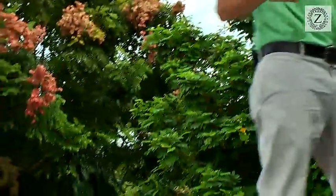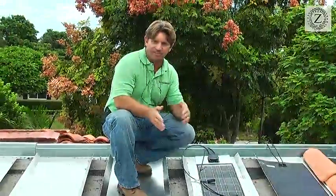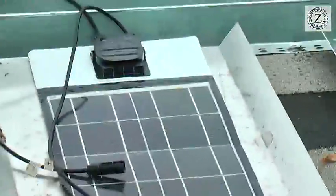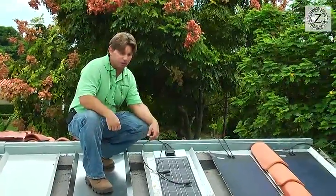This laminate you can walk all over — you can drag your feet. One of the advantages of the metal pan system is that it has a variable width and a variable length. This would accommodate other thin film technologies like the SFX1 panel by Solopower. Along the ridge, we would be able to place more panels if an increased power density was required.